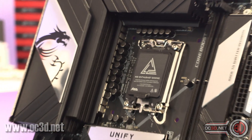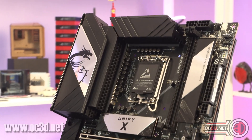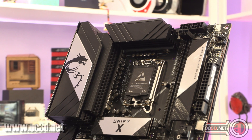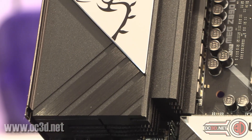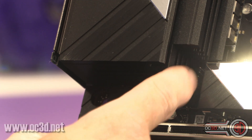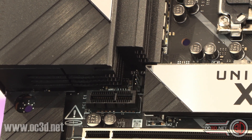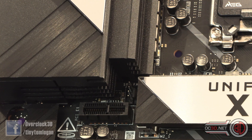We can see those 20 plus 1 plus 2 plus 1, 110-amp phases. The difference between VRMs may be something you'll want to keep an eye on long term. There is a PCI Express 1 header here, which we really don't see very often. Also hidden away is system fan 4 nestled in there. I really dislike fan headers hidden like that — some of you may want to connect a rear 120mm fan or a CPU heatsink fan there, but it just makes cable management unnecessarily messy.